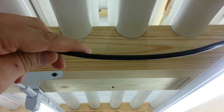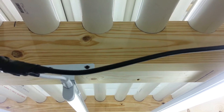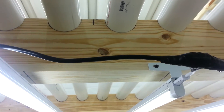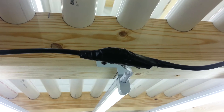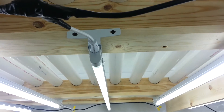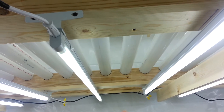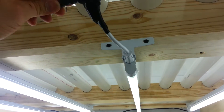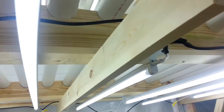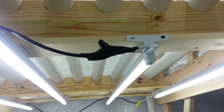What I did is this black cord here is actually a computer electrical cord. I'm an IT technician by trade, and one of my clients had a giant box of this stuff just lying around that they were going to throw away. So they let me take that and I've turned that into a wiring harness. This particular model you can jumper five of these fixtures, but in the way I'm doing it, these are basically pigtails — how you would do the wiring in a wall. So I've got one whole side with just six lights pigtailed with that line going back to an outlet.